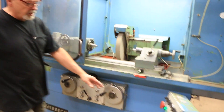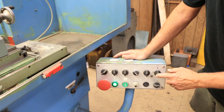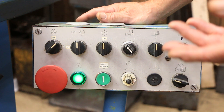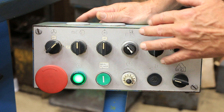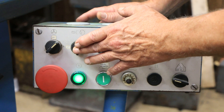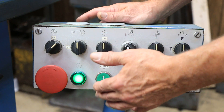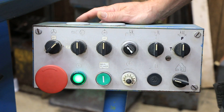Over here we'll look at a couple of these switches. You have one for plunge grinding and traverse grinding. There's a clutch for the table — if you want to move the table by hand you disengage it from the hydraulic cylinder. You don't have to use the spark out, so you can have that either on or off. This is the coolant pump, this is the grinding wheel on/off, your headstock on/off, an indicator light that the machine is running, your machine start button — this is the first thing you press after starting the main breaker — and of course this is your emergency stop button.